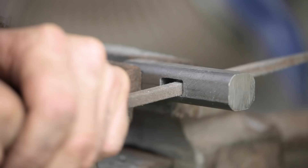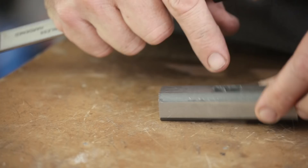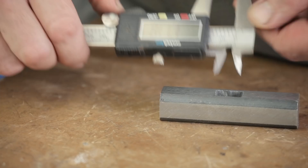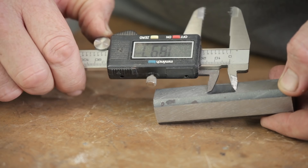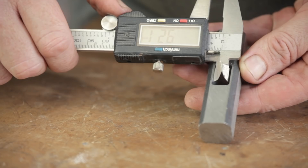It's starting to look a little bit like a hammerhead now. I've finished filing the eye out and I'll just show you the dimensions. I've tapered it in both directions — this is the underneath of the hammer and we've got just over 17mm, and then on the other side, which is the top of the hammer, there's a bit of clearance there at about 19mm. I've done it in the opposite direction as well: 9.2mm on that side, and there's 10.5mm clearance.